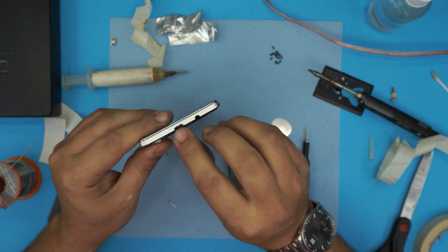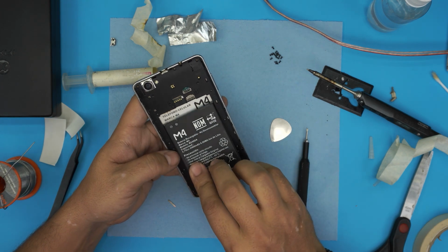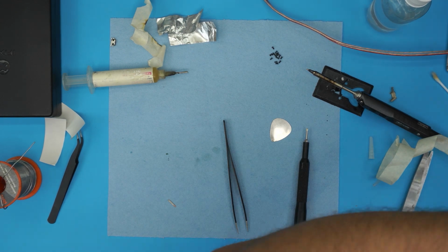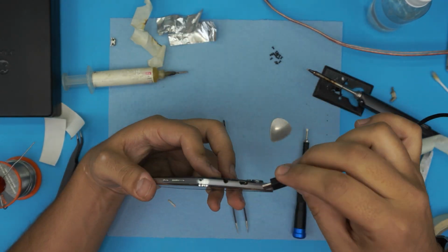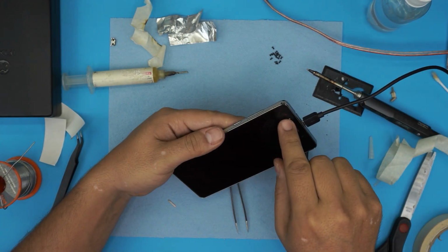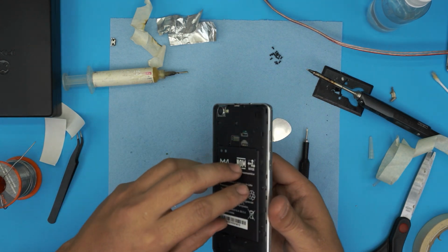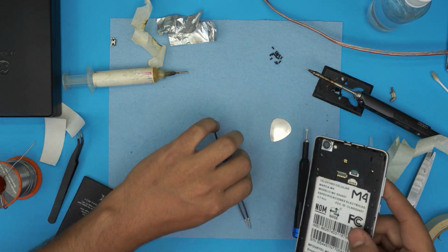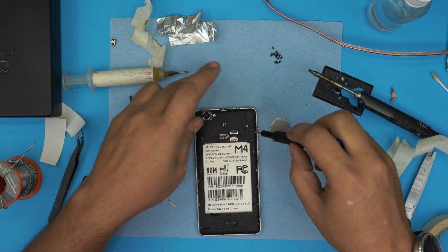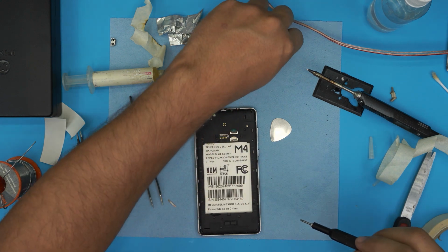Alright, before we put the screws in and do anything, we're just gonna test it out. So grab the battery, plug it in, grab your charger cable, and connect it right there. And the light is turning on, it is red. That means it's charging. The light turns off. The battery is really dead on this one. So the last thing would be to put all the screws back together. The screws go all over the place. They don't have different heights or sizes, so don't worry about mismatching.